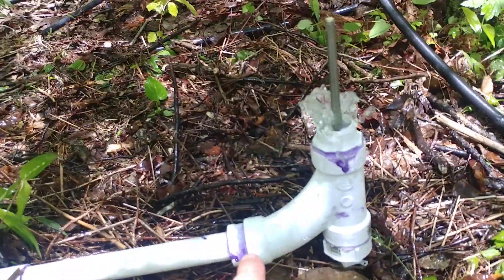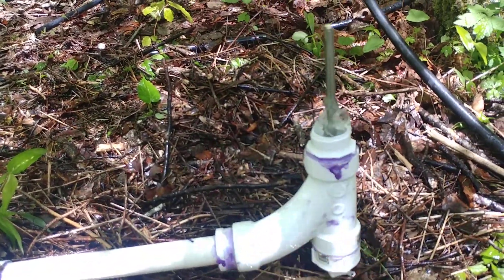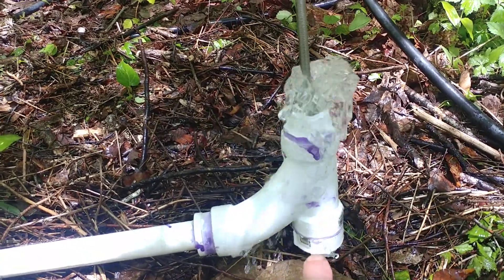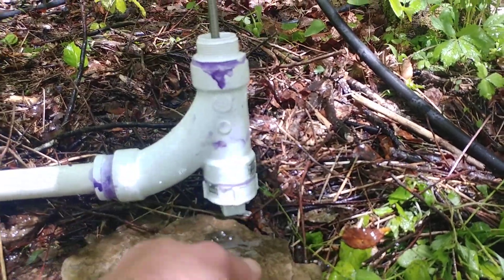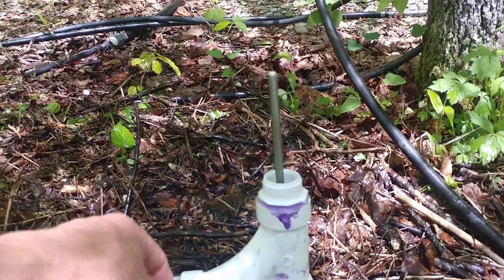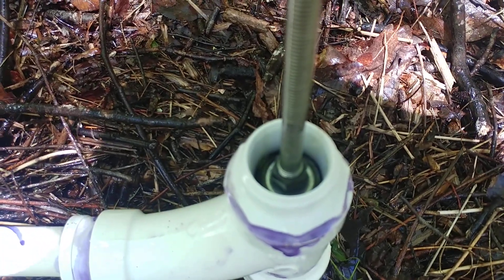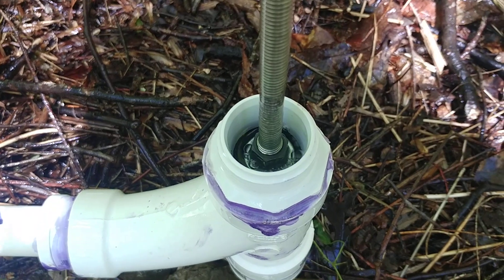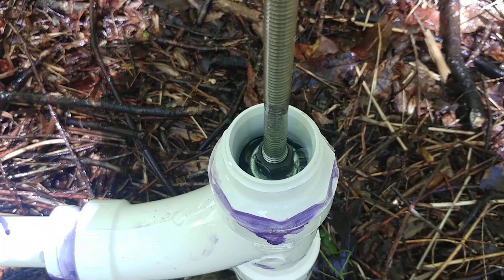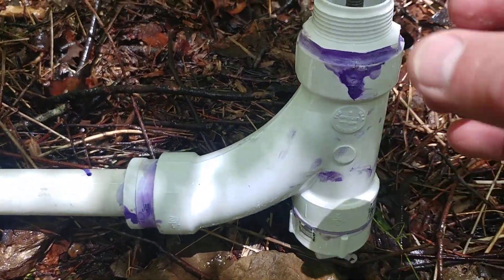Basically I took a one-and-a-half-inch sanitary T, reduced it down from the one inch. At the bottom I have a coupler with a slip and then threads, and basically I have a cap on the bottom of that. That cap allows me to open it up and pull that all-thread out — that's three-eighths all-thread. Down in here I have some rubber grommets squeezed together. On the bottom I have a one-and-a-half-inch washer pushing up on that, and a smaller one so that one can actually meet with the PVC. At the bottom I have the same thing going on, so it keeps it centered in the pipe.